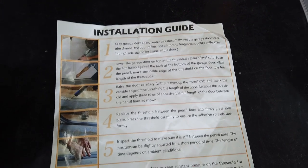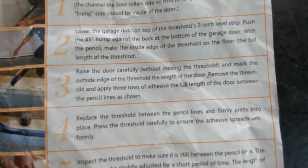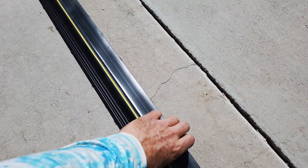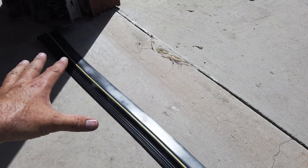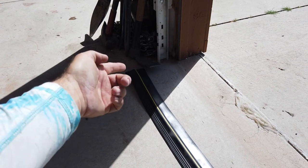Here's the directions on the other side and they're real simple. If you want to read these directions, you can just pause it. Obviously I swept this with the broom. I even wiped it down with MEK just to make sure there was no oil on the cement. If you flip this over, it just wants to roll back up. It might be a good idea to keep it inside where it's not cold, or set it out in the sun before you do it so it evenly heats up — this is very soft over here where it's sitting in the sun, but over here in the shade it's still curled up and I can't get it to straighten out. So I might have to hold that in place with my hand before we get the garage door down on it.